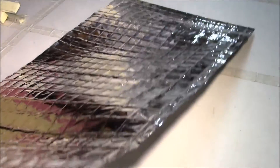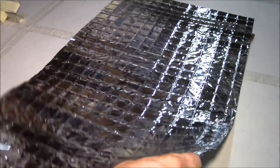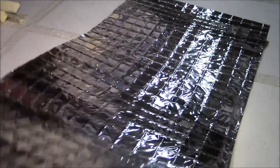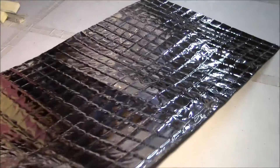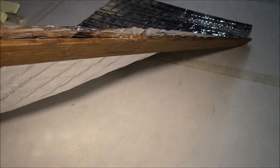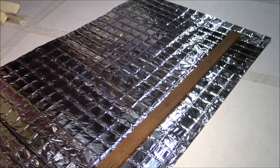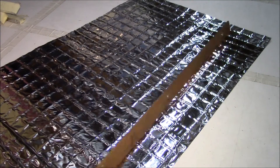What I was able to do was clip the stick underneath the sheet, hold it out, support it, and get it into place. The trick is to get one side clipped into the rafter, then bend it — that holds the other side in. The hard part is getting that first side, and this stick with three rare earth magnets worked just perfectly. That was the greatest little tool, and that's how I put this in.